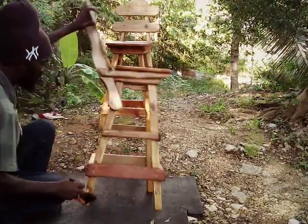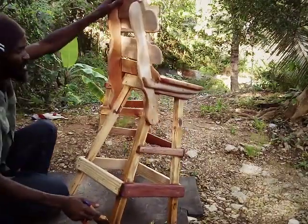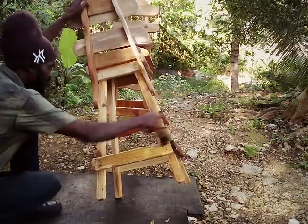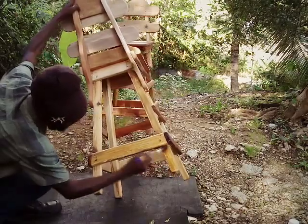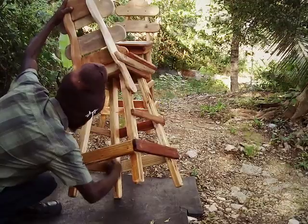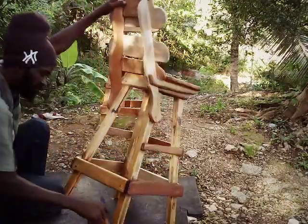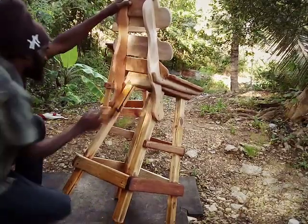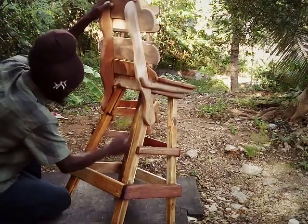because remember, in one of our finishings, we put on the sealer, we brush on the sealer or spray it on, and then let it dry for a while, then slightly rub it off. So actually, the first stage of spraying a furniture, you could do this. Yes, because the first stage of spraying a furniture is putting on the sealer.